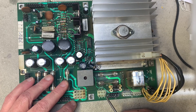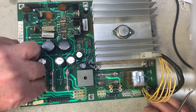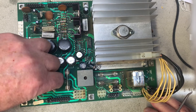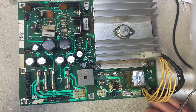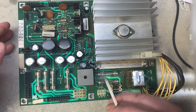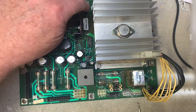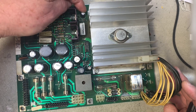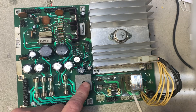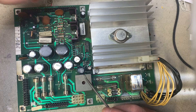I typically pull one from CN2 and move it to pin 12, then put this one back over here. Data East games — the fuse clips are always suspect, so if you grab a hold of the fuse and give it a little wiggle, if they're still tight and the wings aren't flapping around they're probably okay. Somebody has changed out C2, C1, and C4, but they missed C7 which is a cap that typically leaks on this power supply, so I'm going to clean up the installation of these three caps plus change C7 out.